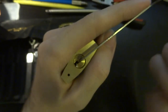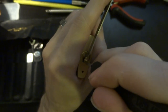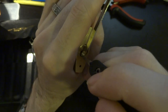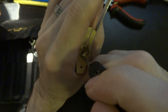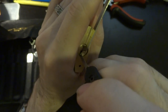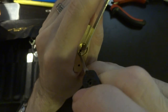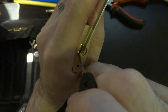So we're just gonna get that seated in there. This one anyway tends to bind from the rear, so we're just going to start at the back with pin number four, feel around in there, try to find where it's binding — and there's number three — and we're just going to keep working our way towards the face of the lock.